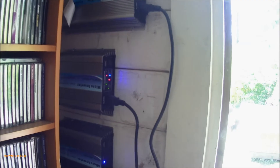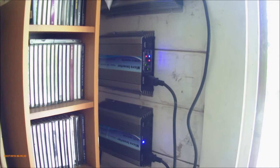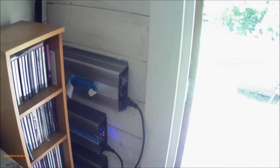We've had them on for about two and a half years and generated nearly 2000 kilowatt hours in that time, which isn't bad for this part of the world — we do get quite a lot of cloud and rain. At the moment we're generating about 380 watts of power, which is about half the rating of the panels, but I do need to get up there and give them a clean, and it's still quite early in the morning so we've not got the benefit of full sunshine just yet. That 380 watts is more than enough to provide power for the house at the moment.